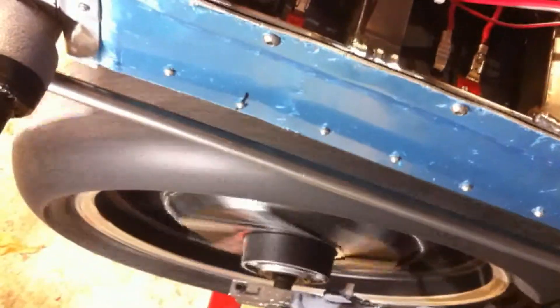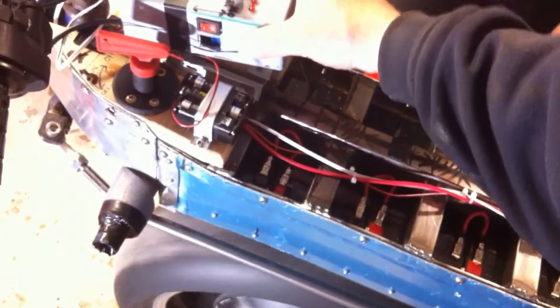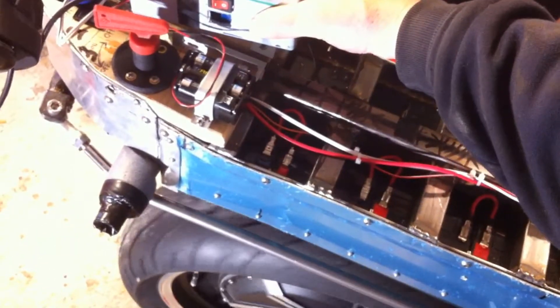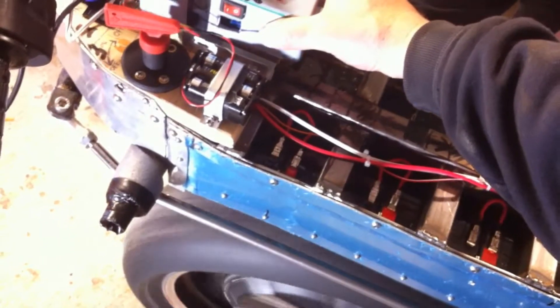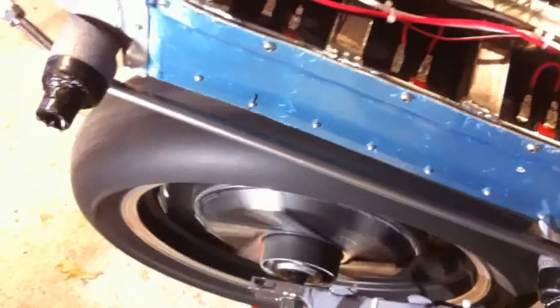So as I tilt it forward the wheel goes forward, and as I tilt it backwards the wheel goes backwards. What happens if I tilt it forwards quickly? You can see it's fairly... if you can get that. Now you see — if I go hard forward, that's the maximum speed of the wheel, but I've set that in the Kelly controller software to 21%. So we'll stop this test now and change that to 50% and see what happens to the wheel speed.